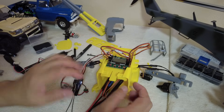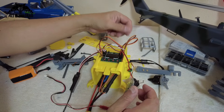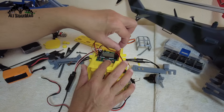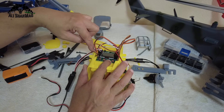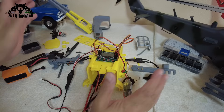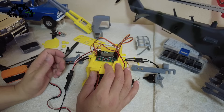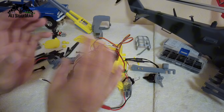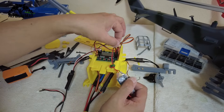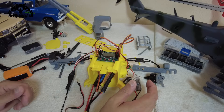The KK2 board only has two flight modes: manual or auto-leveling. You don't want manual — you can do flips and aerobatics in auto-leveling mode with the right PIDs. Let me recap the connections: the right side are the outputs — ESCs and servos. The UBEC is on one of the outputs, and a cable bridges from one output to the left side to power the receiver. You need this bridge cable to share power between both sides.